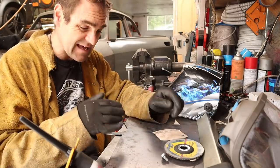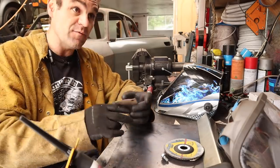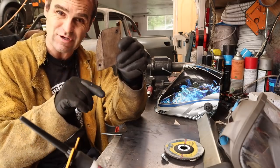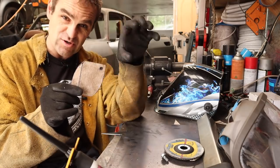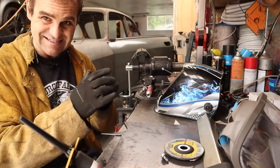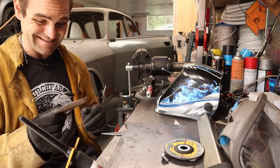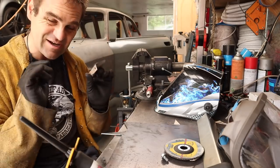The mounting plates are in the car. The next thing is to start making up the base plates — these are for the feet of the rear bars. I used my same template, just curved the corners a little bit. I'll round off the sharp points when I put it in the car. I like having a slightly rounder foot on the cage because that's the bit you're lifting in and out, and when it's trimmed, less sharp pointy bits is nicer if you accidentally touch the interior trim — it's not going to stab a hole in it. Let's get the plasma out and cut a couple of these out.